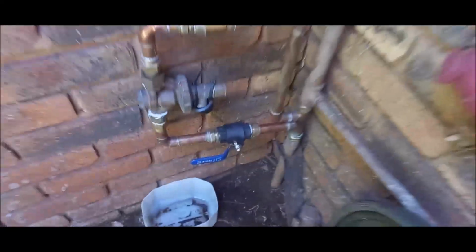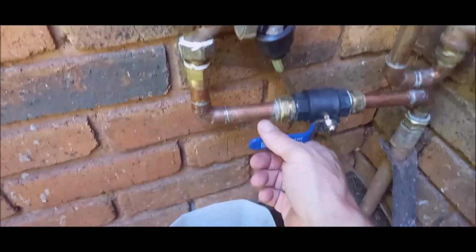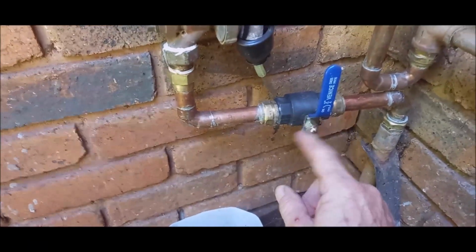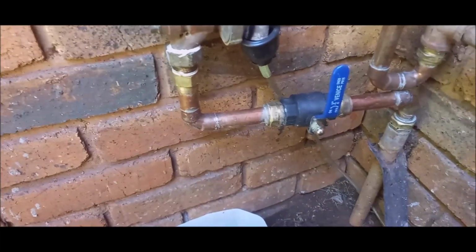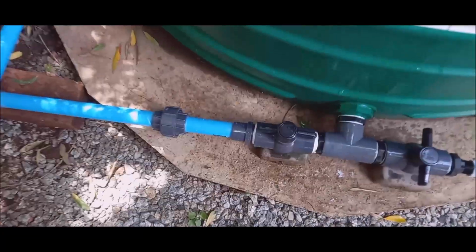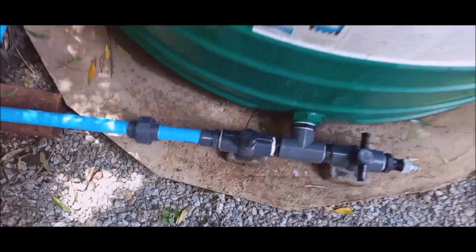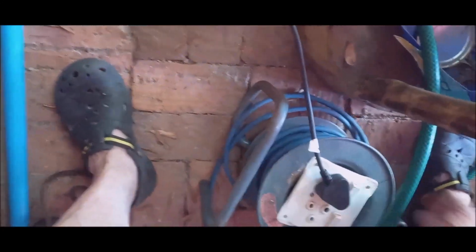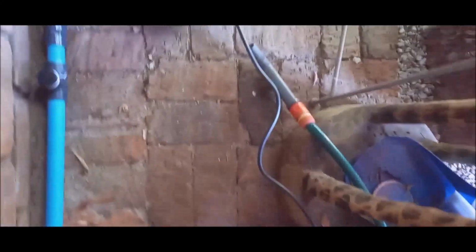Okay, right, I'm gonna test the unit now. I'm gonna switch off this valve from outside. Municipality water is off now. Now I'm going to the motor and switch that on, and I open this valve out of the tank. Just run it over extension at the moment. I didn't put in the supply yet.